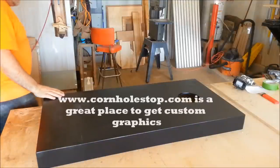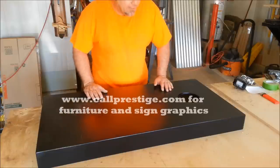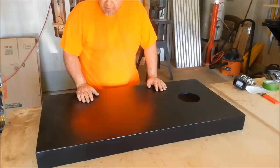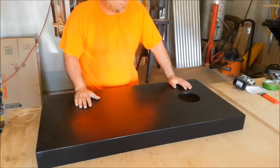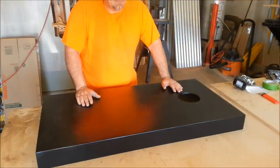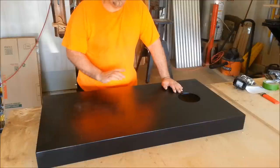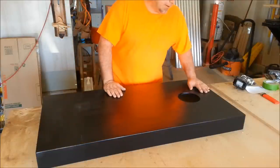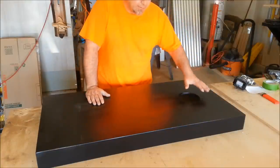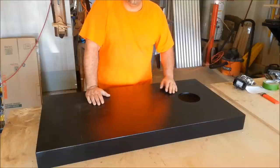Let's talk about surface preparation. I built my cornhole boards out of half-inch plywood that is already primed on one side, so that makes it handy. Once I put another coat of primer on it after it was built and sanded out, I put one white coat of gloss paint on the top and two coats along the sides where the sides are going to be exposed. Now, you can put this stuff on bare wood, but I never have. If I put it on just a wood surface, I typically will do a spray shellac or something over it, then sand it out before I put it on. You want to make sure that your surface is nice and smooth — anything happening on the wood will show through, will come through the vinyl. If there are small divots or whatever, you'll see that when the vinyl is put on.